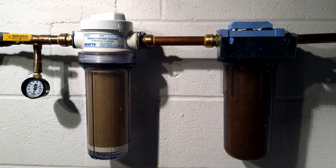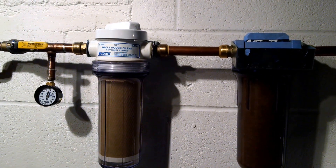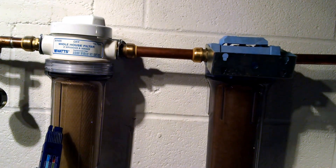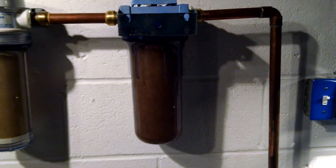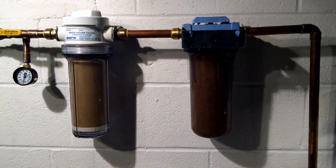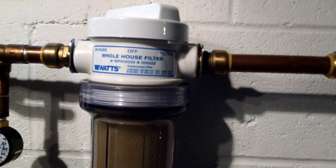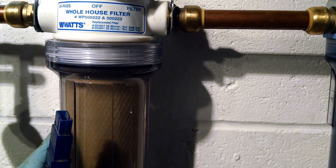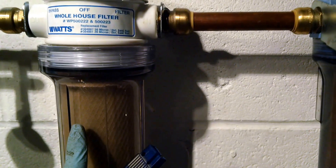The reverse osmosis system isn't terribly expensive — I think it's about $150 for an under-sink system that comes with a faucet and a tank. If you buy filters in bulk, these filters are about $4.50 each; I buy six at a time. The one micron filters are about $2 a piece as well. When it comes to changing filters, this type of housing is very helpful because you can set it to bypass, close it down, relieve the pressure, and when you unscrew it, you can actually continue using your water system while replacing filters.